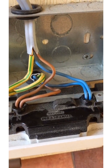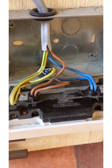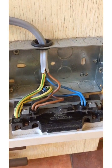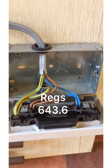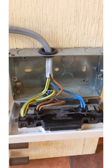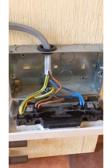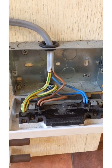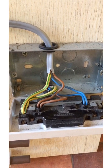I've pushed off the dust so you can see — there's reverse polarity in the socket outlet. Some of you might have said the lack of an earth fly lead to the back, but what we've been saying for a long time is that as long as we've got one fixed lug on the box there's no need to earth bond the back of the box. I'd be surprised if that still caused any controversy.